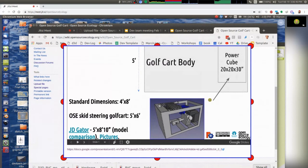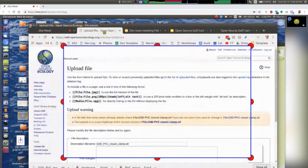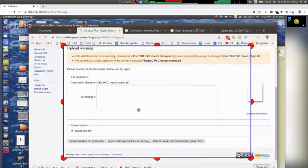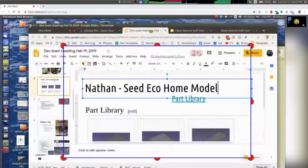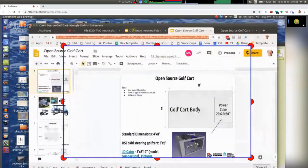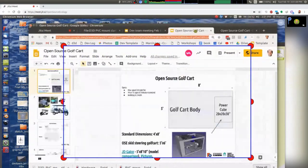The main issue is the frame. This thing needs to be pretty light — obviously don't want heavy steel like a tractor. Quarter-inch sheet metal and cut parts would be helpful. What I'm thinking is quarter-inch angle — essentially a frame like the D3D and power cube: six flat plates, quarter by four, which makes quarter by four angle. That should be plenty strong and still light enough. Calculations on weight would be in order.